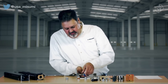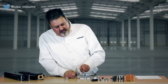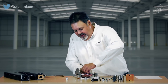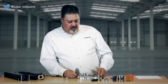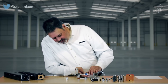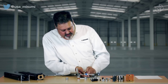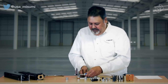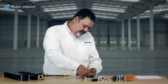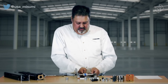All these couplings I have here use a clamping type. We also offer couplings with set screws or keyed couplings. The set screw actually digs into the shaft and can make it a little difficult to remove, whereas a clamping type just clamps around the shaft so it doesn't mar the shaft. Another type is a keyway coupling — the advantage of the keyway is you physically have a piece of metal that creates a key between the coupling and the shaft to keep it from turning. The only disadvantage is you have to have the proper size key for the type of coupling you're using.